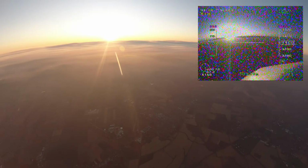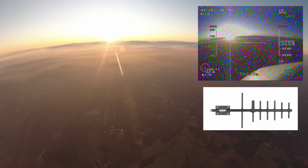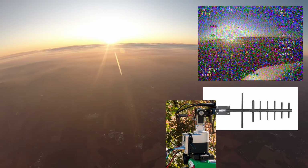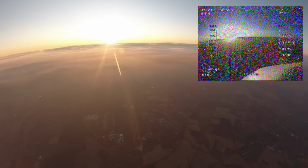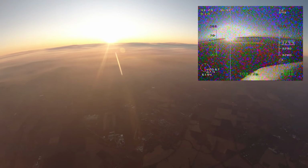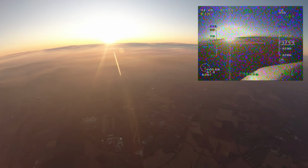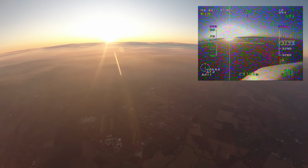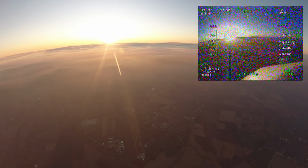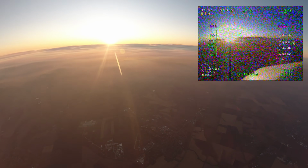about what it could do with some better antennas and a directional one on the ground. Perhaps even attached to the antenna tracker, constantly having it pointed directly at the plane. Should alleviate any worries about radio control range. That is huge in any case, but think about the telemetry link. It will get a major boost in range, and with the optimizations in the MAVLink data rates, you could squeeze even more range out of it by omitting some data from being transferred that is not critical.